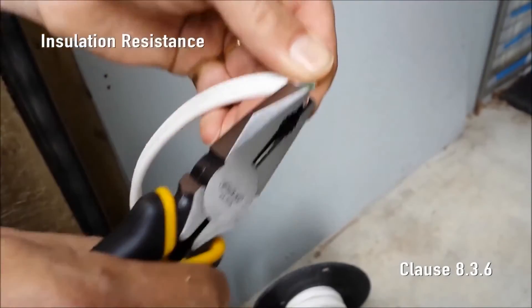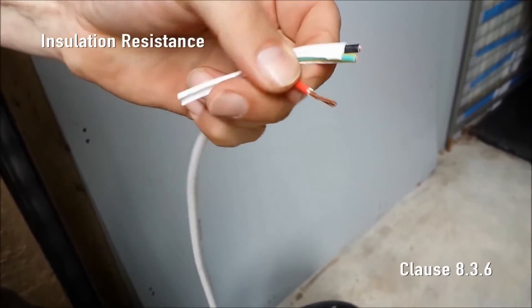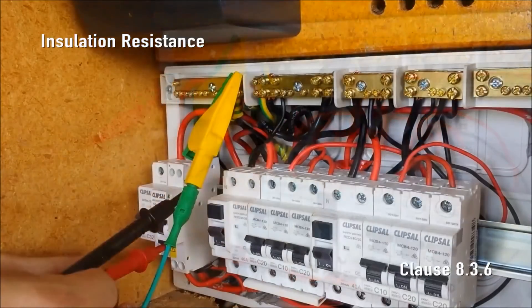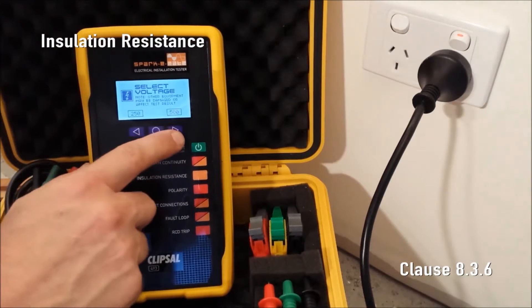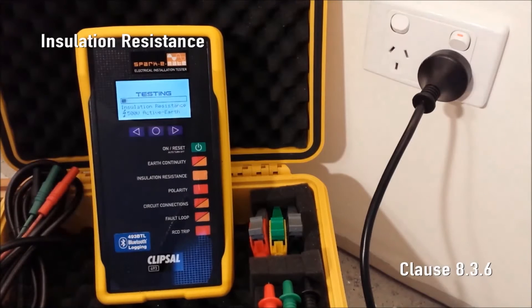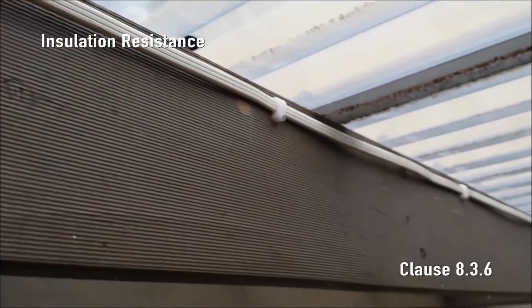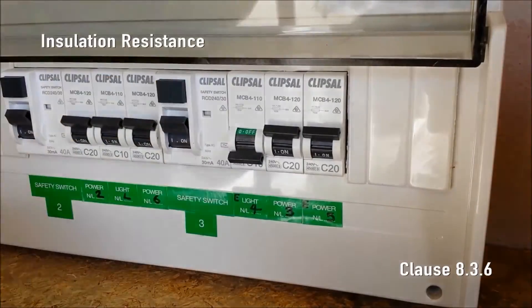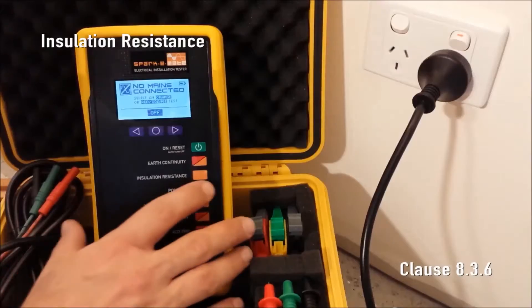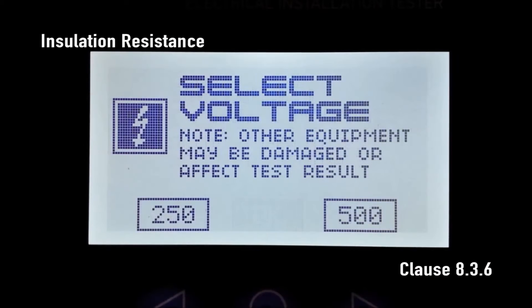Insulation resistance. Thermoplastic sheathed cabling (TPS cabling) must provide very high insulation resistance between live conductors and earth. The insulation resistance of an entire installation can be performed at the switchboard using the 493L test lead set. For today's demonstration we'll run an insulation resistance test from a final sub circuit at a socket outlet. SparkyMate tests the integrity of connections in junction boxes and cable insulation from the switchboard to the socket outlet. The insulation is stressed by applying a direct current of either 250 volts or 500 volts. First turn off the circuit breaker for the sub circuit under test, then press the insulation resistance button and select the required conductors to be tested. Now choose either 250 volts or 500 volts.